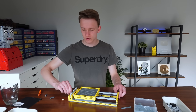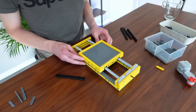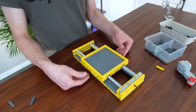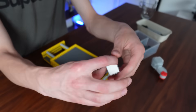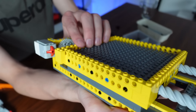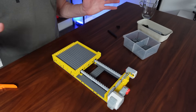This is still quite difficult to turn so we're going to add a little gear reduction. I also want to make sure it doesn't move from side to side, so we're going to add something to keep it in place. Now we cannot move it side to side anymore. The next upgrade is this touch sensor so we can automatically find the position of the bed. Let's add it on the back — it touches perfectly — and finally let's add the motor, completing the y-axis.